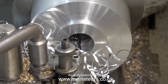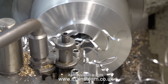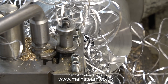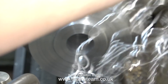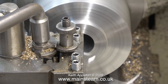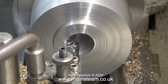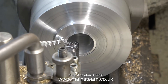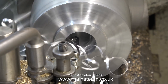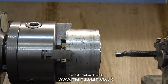Time for the health and safety notice. As you will see, there's quite a lot of swarf being produced — from the beginning of this machining operation including the drilling, an awful lot of this stuff is produced. So you have two choices: you can either be sensible and remove it frequently using a pair of pliers and deposit it in a suitable receptacle for disposal, or you can pick at the bits with your fingers and cut your fingers to ribbons. When I take too deep a cut it chatters a bit, so I'm spraying it with some WD-40. Paraffin, white spirit or even WD-40 is quite a good lubricant when you're cutting aluminium — it still doesn't decrease the amount of swarf made though.